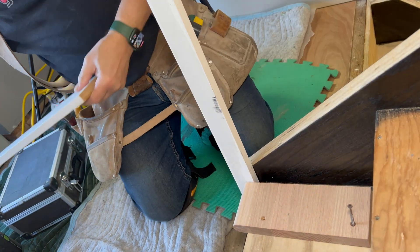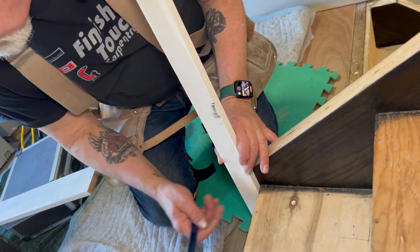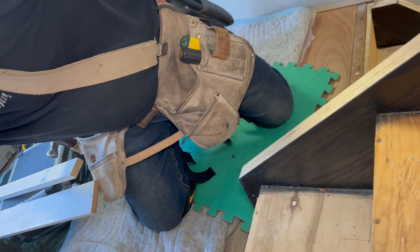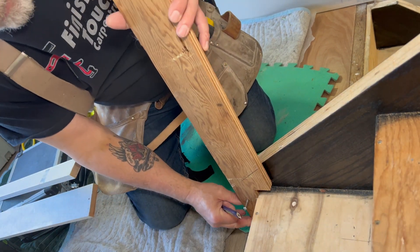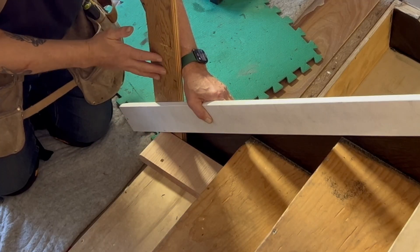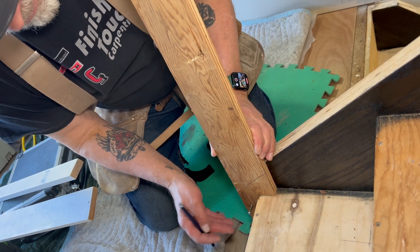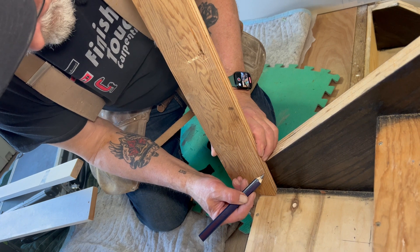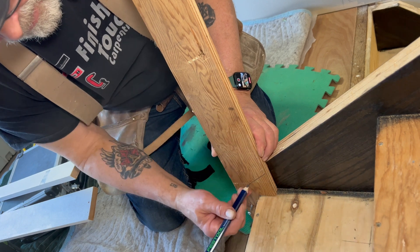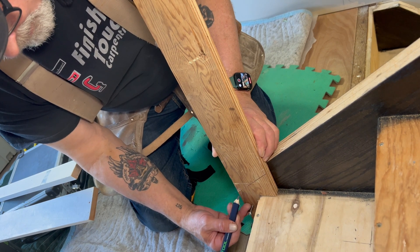One of my viewers who was really paying attention pointed out that if I mark like this, but then install the post so that it laps onto the staircase by an inch and a half, then the rake line should actually be marked at the front of the post. His name is Steven Williams — thank you very much, Steven. That is a very accurate assessment, because as you go across the post, the rake line gets lower as you go.